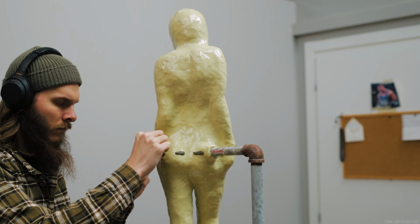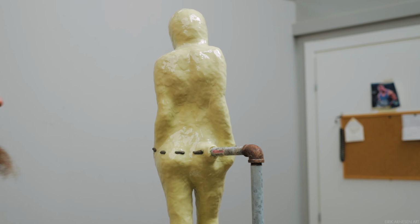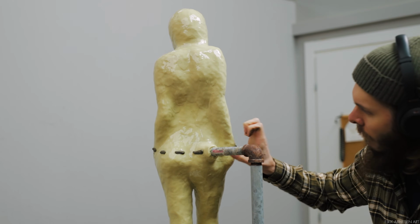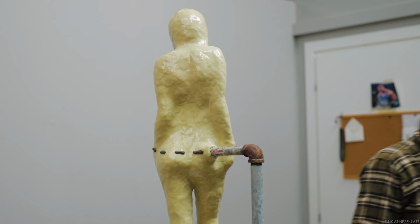However, there are some modifiers that change things, of course. There always are. One of these modifiers is the source of my first decision, and my first decision is going to be to separate the upper and lower half of the mold. This accomplishes two things. Number one, it really eases casting and gives me easy access to the inside of the mold when the mold is closed.